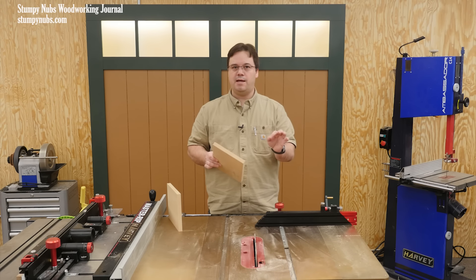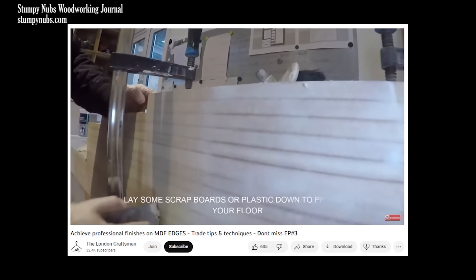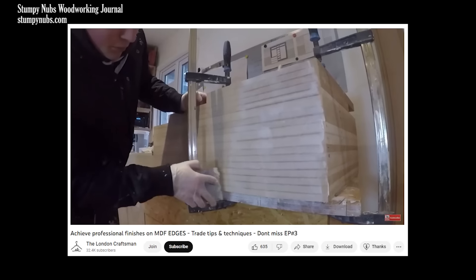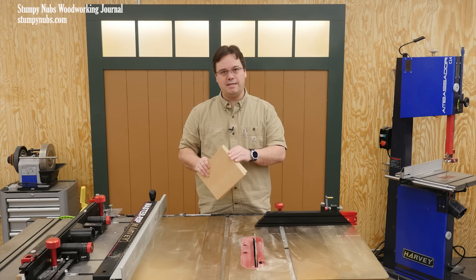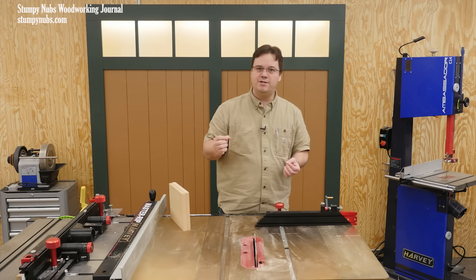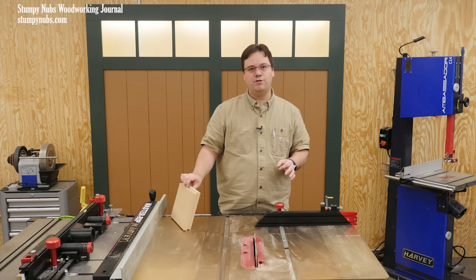You might follow a multi-step process. First, sand the edges to 220 grit, then apply drywall joint compound — use a putty to press it into the fibers in the edges. If you have a lot of identical parts, you might stack a bunch together and do all the edges at once. When that filler is dry, lightly sand again with 220 grit, then put on some primer. The fibers are going to soak up that primer and the edges will be a little rough again. Just lightly sand them smooth with 220 and you'll have a glassy surface ready to paint.